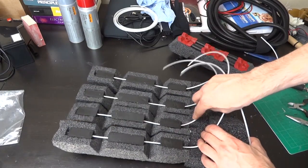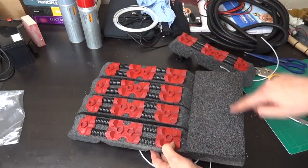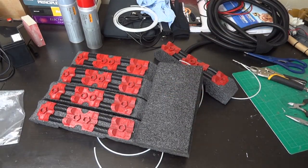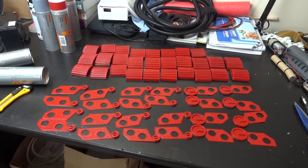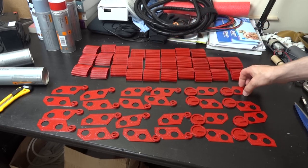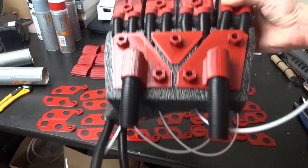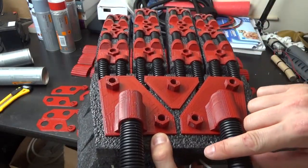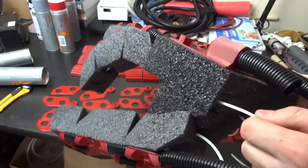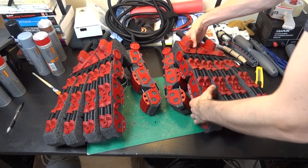Pulling any of these strings, I can open and close the hand. I've got all of those bits on there but still have some pieces to add for the hand back and the edges of the fingers, and I still need to attach the thumb. Several days later, here's the next batch of 3D printed parts: grippy finger grip pieces for each individual digit on the inside of the hand, sections that run down the side of the fingers to look like hinges, and hand-back pieces with conduit holders. With the thumb mounted and the filament pulling, I can bend the fingers.